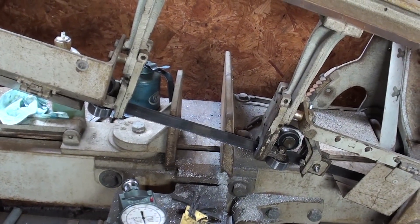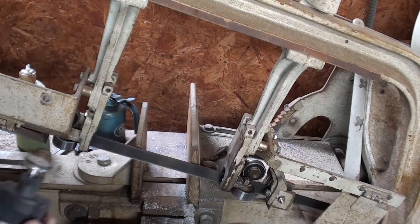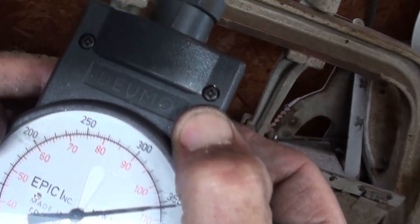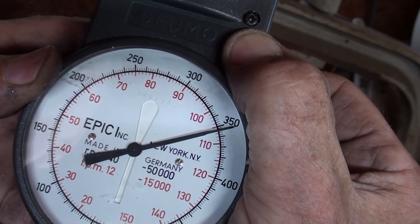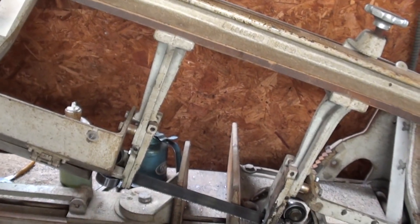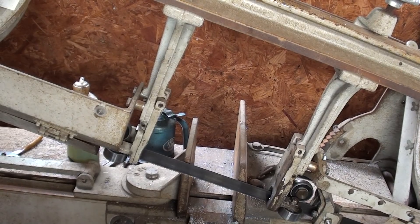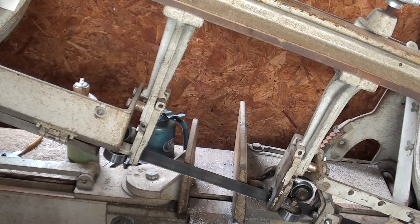Well, let's take a speed reading. I'm at 105 feet per minute, and that was strictly by luck using the pulleys I had in stock. That's really right where I want to be for steel cutting, and it will even be sufficient for aluminum — although I already cut up all of my pigs, so I don't have to worry about that for a while. I hope that helped you a little bit on how to select and change the speeds on a horizontal saw.